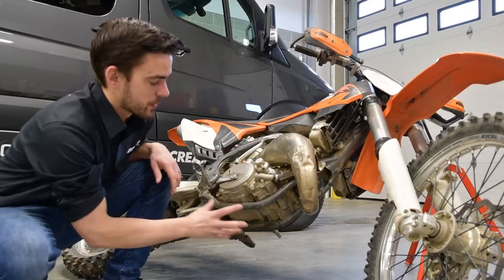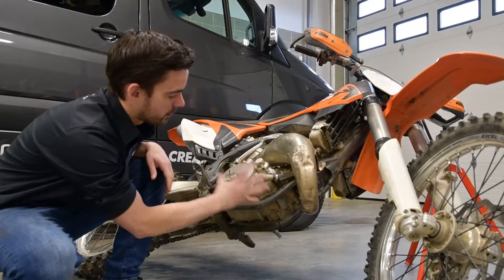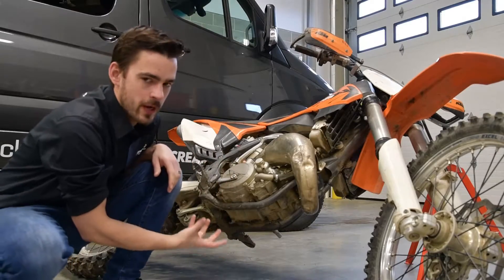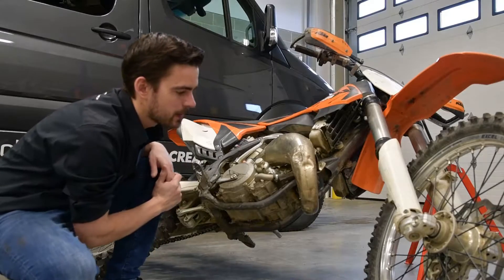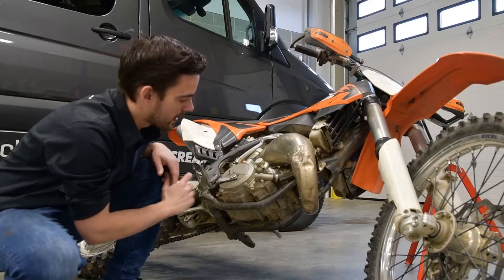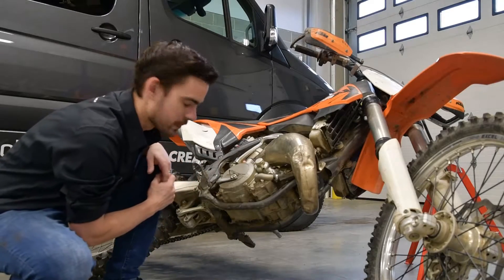It looks like we have more than enough geometry to self-position that scanner without targeting dots. We have the whole engine case and the chassis rails to work from. If it had a very repetitive pattern, such as the spokes on a wheel or something, we'd have to use some positioning dots to prevent it from skipping around. But it looks like we have more than enough here, so let's go get the scanner set up and get to work.